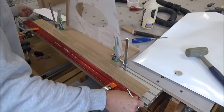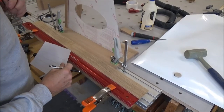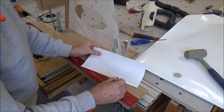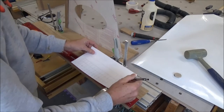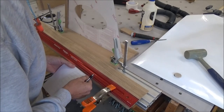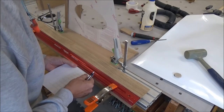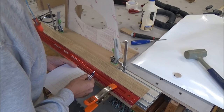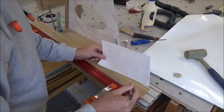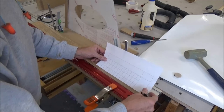Okay, laying out the holes for my scoreboard, basically. What I've done here is, with this ruler, and because these are 5/8 of an inch apart this way, and I believe it's about 7/8 the other way. Hang on here. It's kind of an oddball number. Just shy of 7/8. At any rate, what I've done here is this is going to be minus 10. This is 0.